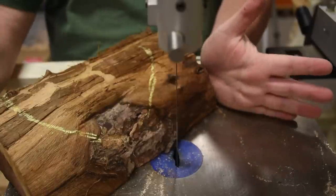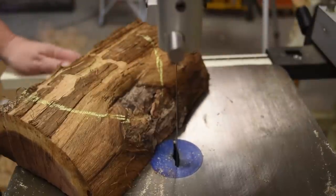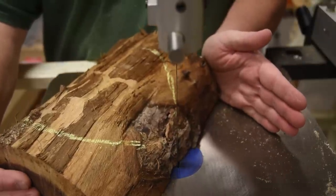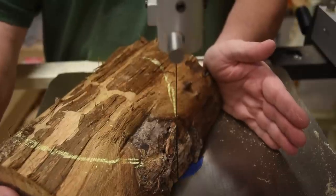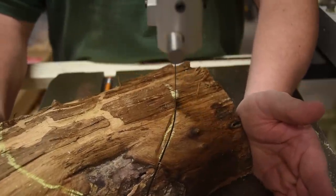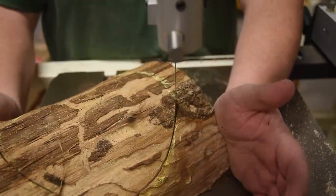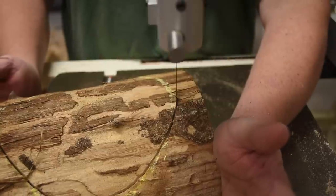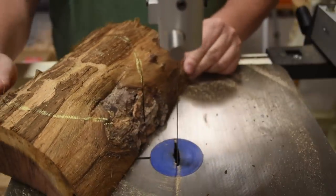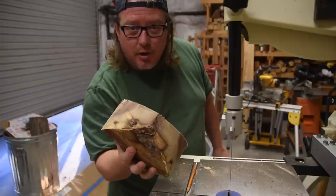I've got my corners on and I rotate in a circle around the blade, never pushing into it. I now have a nice little bowl blank, and I didn't risk my fingers, thumbs, skin, or anything like that on the bandsaw.